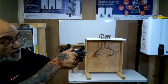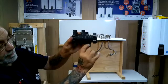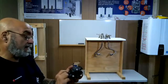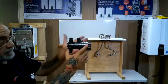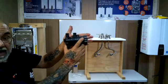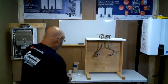Be careful, you can switch it. So you got to watch, just read the markings on the pipe. You'll see here, it'll say hot in, hot out, cold in, cold out. And it has to sit flat up against the back of the cabinet, whether it be the kitchen or the vanity. So, what is it going to look like?